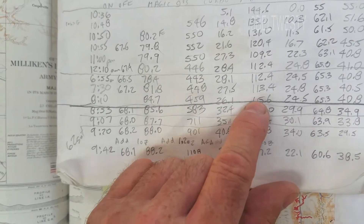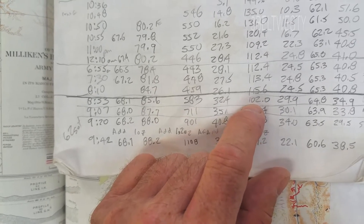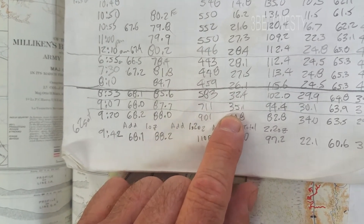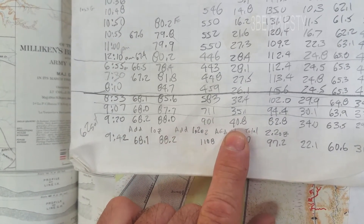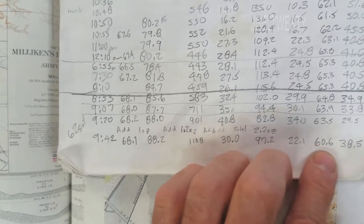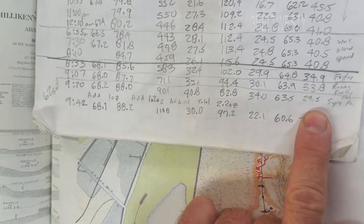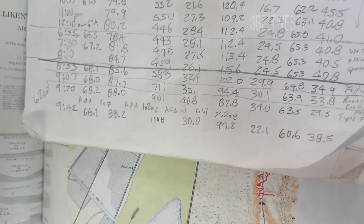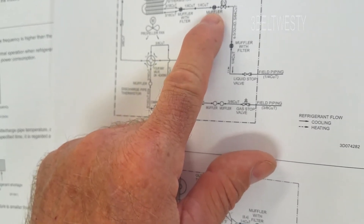So the wattage went up, and the pressure started dropping because it's pumping more refrigerant - it's probably going ahead and opening up the electronic expansion valve. The superheat here was 32-35, and by 9:20 it was up to 40 degrees of superheat, which is really high. The pressure was down to 82 and the inlet line was down to 29 degrees, so you're going to end up having a freeze-up - it's running out of refrigerant.